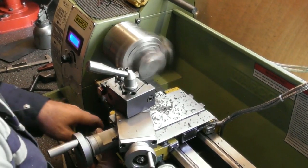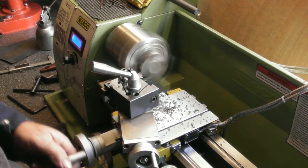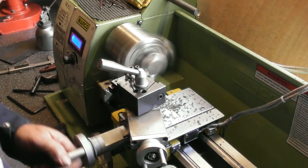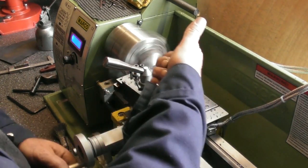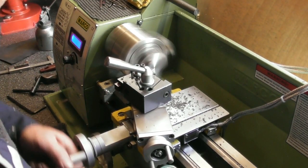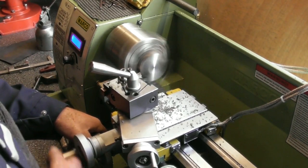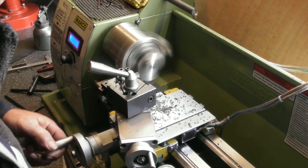We're just on the final side now. That'll leave 0.1. So I cleaned up both sides 90 degrees round. As I cleaned up the second side, I set my DRO to 0. Then I cleaned up the one on the 5th side, so to speak, flicked it round, and now I'm going to do exactly the same dimension by coming into 0 again on the DRO. So that'll keep the block square, so that it measures the same in both directions, so to speak, as opposed to rectangular.